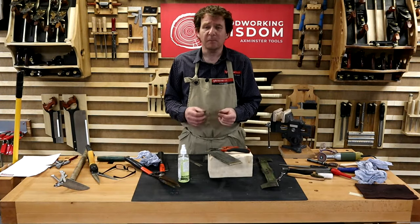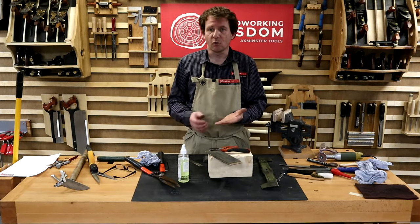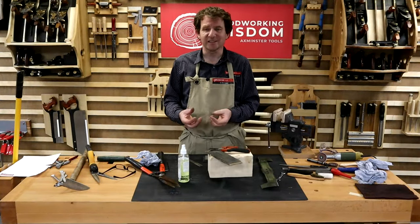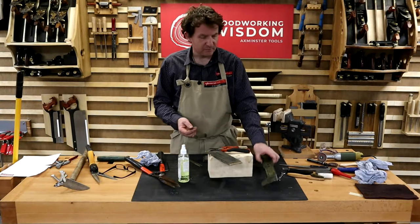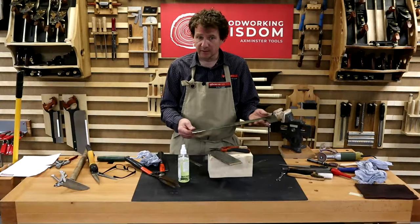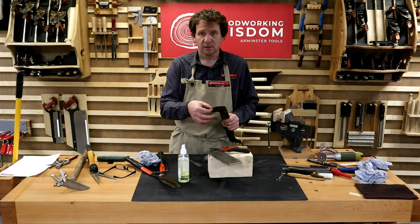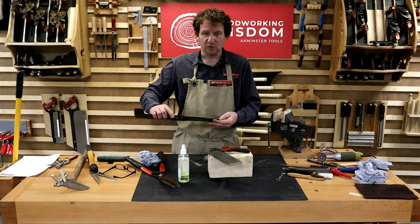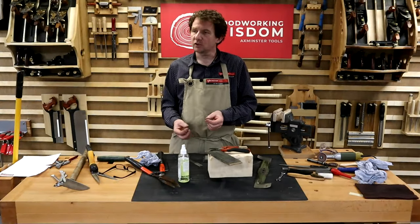You possibly can. It depends on if it will come apart, okay? So if you've got something like a linisher grinder or even a bench grinder, the problem with that is the support and the accuracy. Very difficult. We're going to do a lawnmower blade later on. I looked at sharpening this on a bench grinder, but this blade on here, it's all curved. So you can imagine trying to sit this on a table like a lawnmower blade, it's going to rock about. So you need to look at how you can support it.